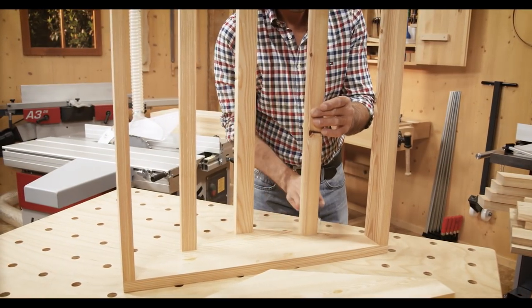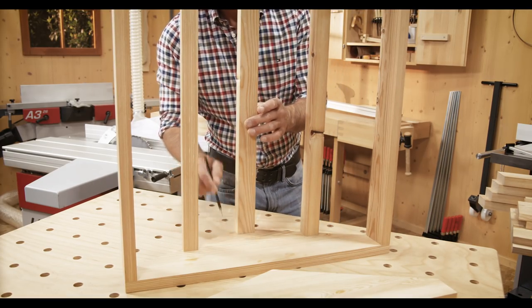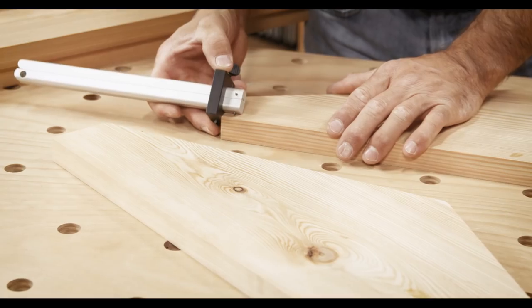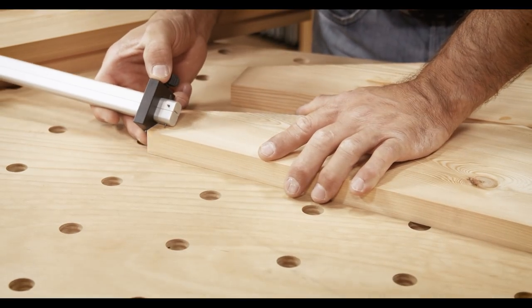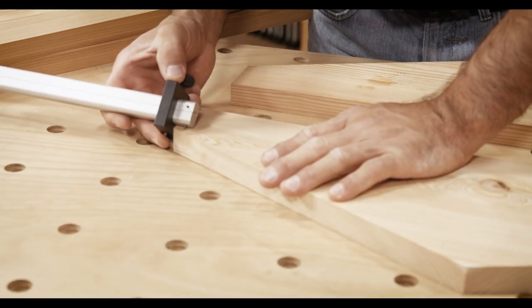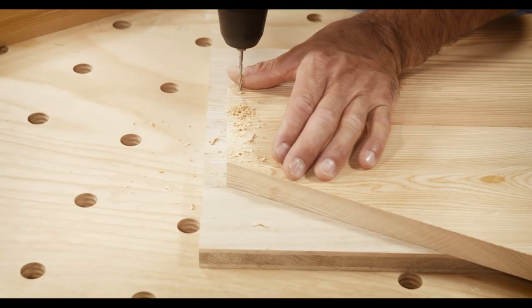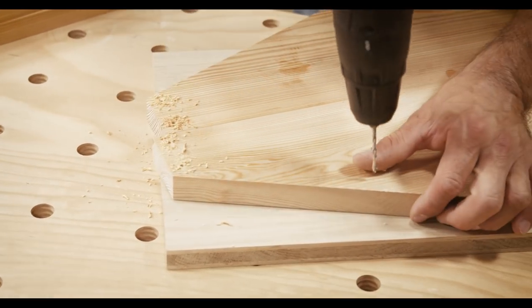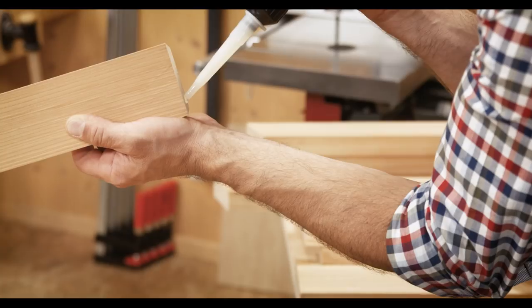We start with the marking of the roof construction to tag the positions for the chisels. Recurrent spacings are best marked with a marking gauge. In order to control the climate for our bee population, we try to make the rooftop as airtight as possible. The resulting air cushion provides perfect thermal isolation in summer and winter.